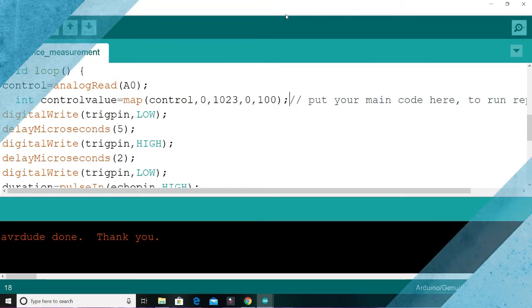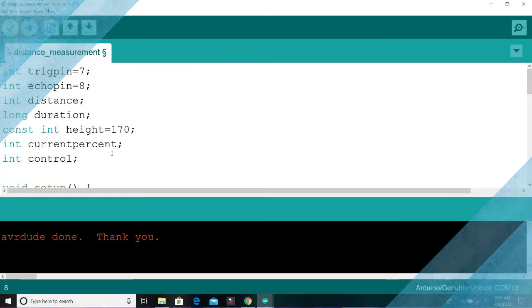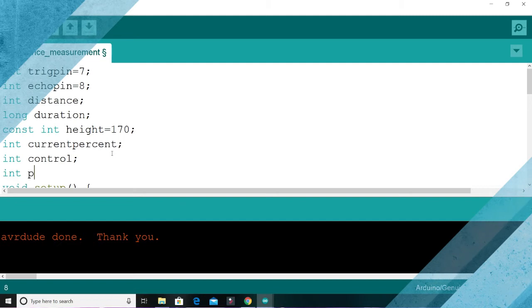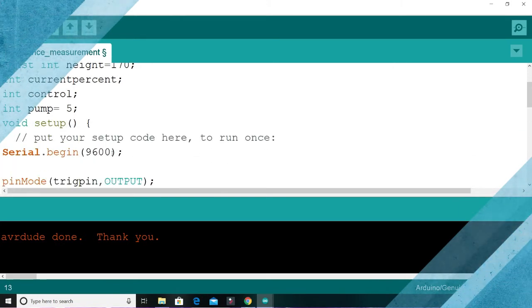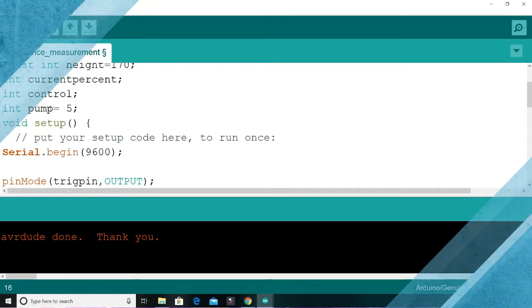So now let's come here. Let me define another variable called pump, and this pump will be connected via relay, and this relay will be connected to pin 5 of our Arduino. So on pin 5, this so-called pump is expected to be what? An output, because we are going to be writing to it.